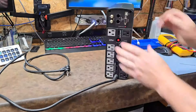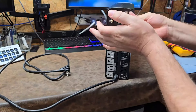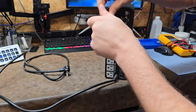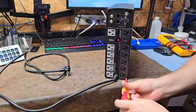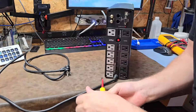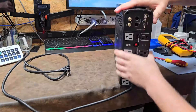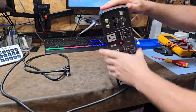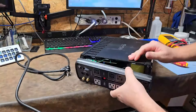To open this up, I believe we need to access through the rear. Should be a number one Phillips. I count four fasteners on the back cover. Normally UPS systems have an access panel of some sort, but CyberPower is not that easy. There are also a couple of fasteners on the front to take off the front panel. My guess is the back panel is how you get into this unit — but it's got some plastic snaps and doesn't give up easily.